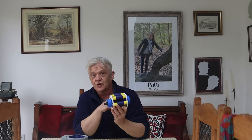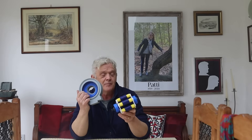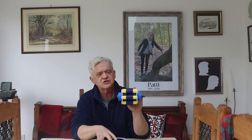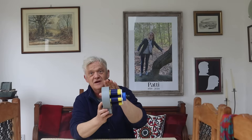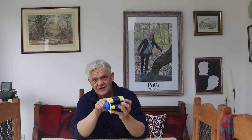Now everything has to turn separately — the inner sun has to turn, the outer rollers have to turn all by themselves, and this will go into its separate case that makes a ground wheel. This has to go in there and we want to isolate it from turning, otherwise it'll just catch. So I've extended the axle and added another set of cross roller bearings — that's so it can fit in and this sun can turn independently from the ground case, and the cage can turn independently from everything else as well. We discussed the sun drifting, which is why we put the inner set of thrust cross roller bearings in between the sun.